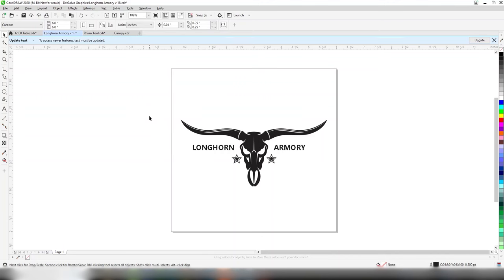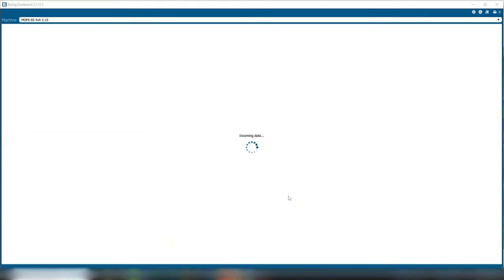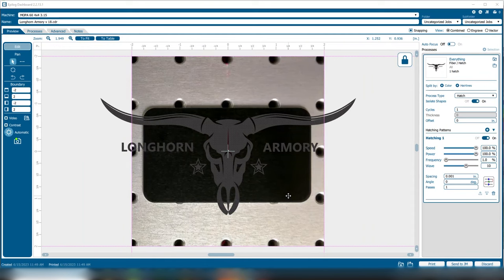You can also use a variety of different software programs — Bartender, InDesign, Inkscape, Engravelab, and Adobe Illustrator. Many software programs work with the Epilog laser systems. It's a really handy feature for customers that have existing software and don't want to migrate to a proprietary software that most Galvo systems are driven by. So we're using CorelDRAW. We've got an image loaded up on screen. Here we select the Epilog engraver and simply click on print, putting the job into the Epilog software suite environment. The graphic is larger than the 4x4 field, so we can simply click on it and make it smaller to fit in the space we want.